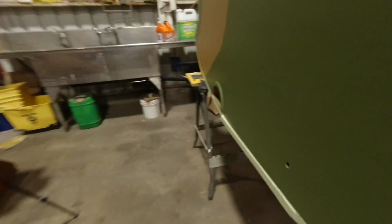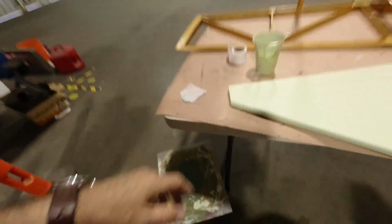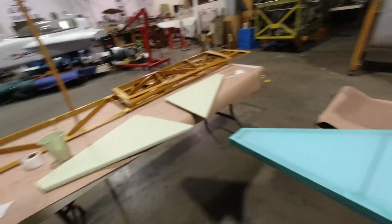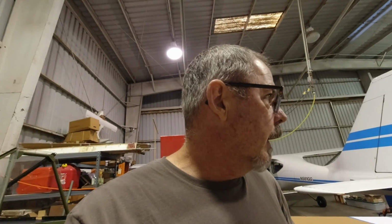And what I'm gonna start doing is I'm gonna clear the holes here for the hinges, and get the hinges installed on the plane. And then once I have the hinges installed, I can come back in and get the holes in the landing gear cleared, as well as the holes down here. So I'll get all that taken care of. Then I'll be able to get the hinges on the plane, and then we'll be able to get the gear legs on the plane. And once we get those, then we can jump to getting the axle installed. And once I get the gear legs cleared, I'll install the aluminum brackets that go on those. Before I do that, actually, that's what I'm gonna do right now.